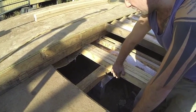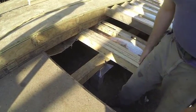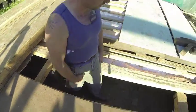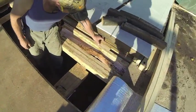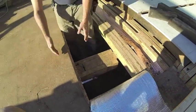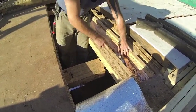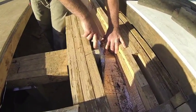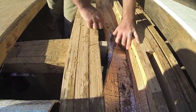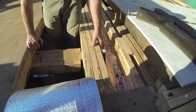The joist section on top is laminated here because we've got additional weight, being the laundry. But if we just shoot across here you can see that we usually have them at 450 centres spacing. And if we have a join we just overlap them. We've also got a joist joiner here, which is between the joist and the bearer, just to lock it in — it reduces squeaks.